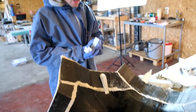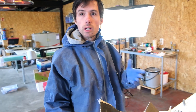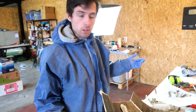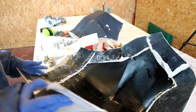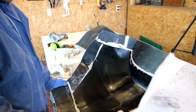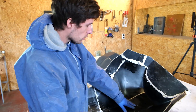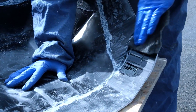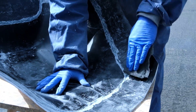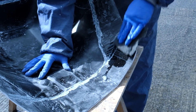Mostly release agent — I just like to sand it to have a good start and a clean mold without any contamination. We'll be using 800 grit just to remove the last little marks. As you can see, these are marks from the release agent — a bit of glass — and you can see a little damage that will be sanded out. It's just to make one piece.